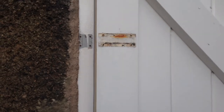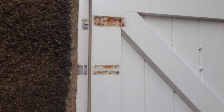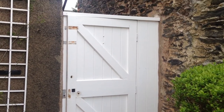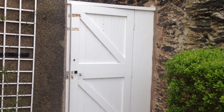So realistically, if this was your gate, or even on a private job, you're going to want to protect that. As you can see, the rust is going onto the woodwork underneath where the ironmongery used to be. So my next plan of action is to rub all this gate down and proceed to undercoat, which I'll show you in a minute.